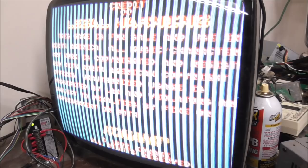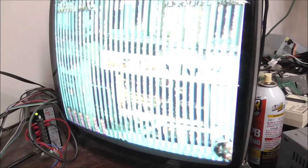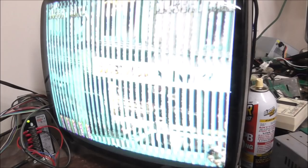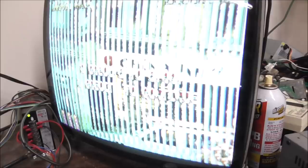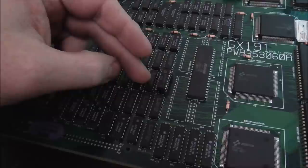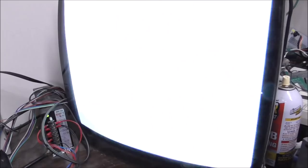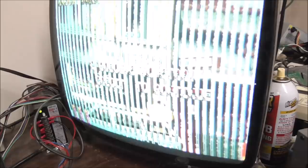So I'm trying to figure out why it's doing that. Whenever it was first coming up, it was telling me that one of the RAM chips was bad. The chip may be bad — when I was checking the RAM, there was a signal missing. Two of the lines actually were missing from the RAM chip. I tracked it back, and the signal that was missing came from this chip here. So we're going to see if the other line is missing, or what the deal is, and why we're getting all those lines.